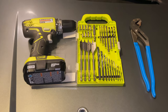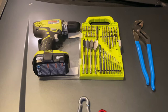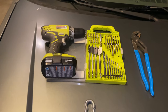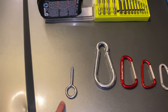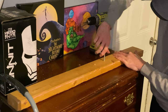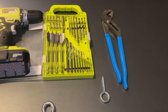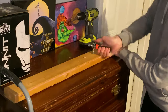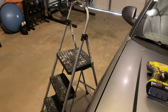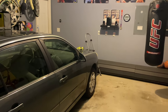I used a drill and some drill bits to get the hole going. If you don't have a drill and drill bit you might want to consider investing in one — they're not that expensive, they last a really long time, and you're probably going to get a good bit of use out of it. You could also get the hole started with a nail by hammering it up into the stud and then screwing into that hole. You'll also need something to screw the eye bolt in with — I used a screwdriver. I definitely don't recommend hand-tightening. You'll also need a chair or step stool since most people cannot reach the ceiling.